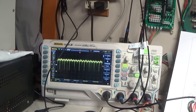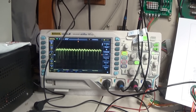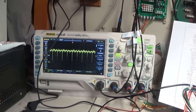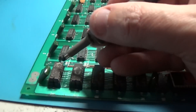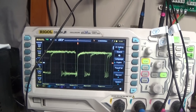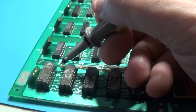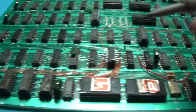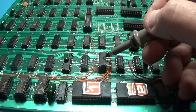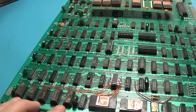See those bits, how they're acting? It looks like crap. So what the regular Galaxian does is it sends this signal over to that 174 to be cleaned up and driven. I believe that one is this one right here - and this is the output of that. Look how good that looks - this is the output of the 174. So what I've done is cleaned that signal up and now let the 174 drive it. That is jumped over to the circuitry. I've just added this missing 174 that they don't put in on these bootlegs. It just eliminates having issues with these RAMs.